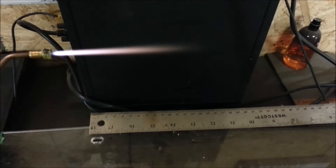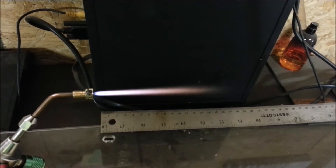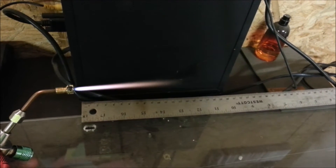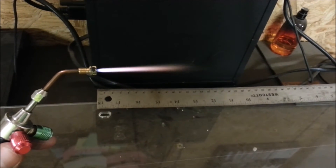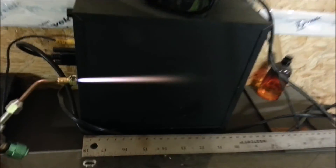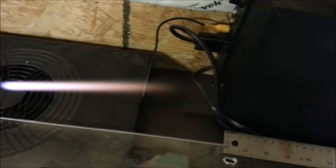Let's get that to about 15 amps and see how much it shrank. There is about 14 and a half amps — it's getting shorter. The other torch tips I have, they don't behave this way. The more you increase the wattage, the longer the flame gets, and I don't need a two-foot-long flame. Approaching 15 amps here and we're definitely getting to the turbo flame. You can't see it as well as I can off camera, but it's got a nice feather going towards the edge.